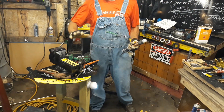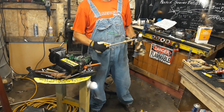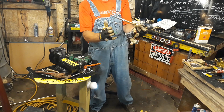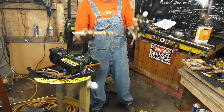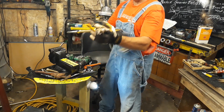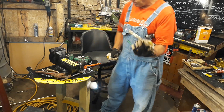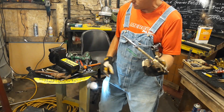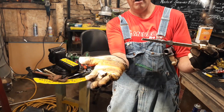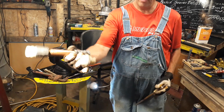Your parts are going to vary. You just can't go to the store where I live and buy a stick of quarter-inch material — the longest piece you're going to find on the hardware store shelf is six inches. When I designed this thing I wanted anyone to be able to go to the store and buy the stuff to make it. The quarter-inch inner pipe needs to reduce down to one-eighth of an inch. The easiest way to do that is to buy an air chuck and cut the end off of it.